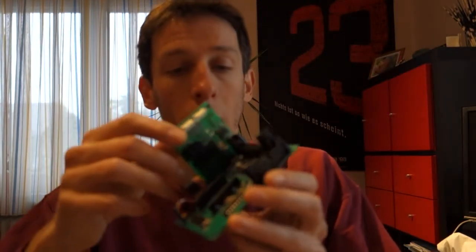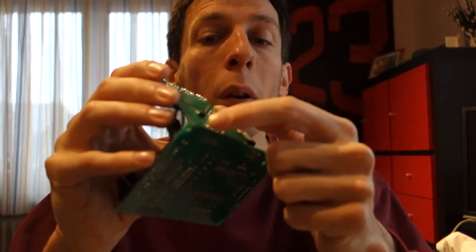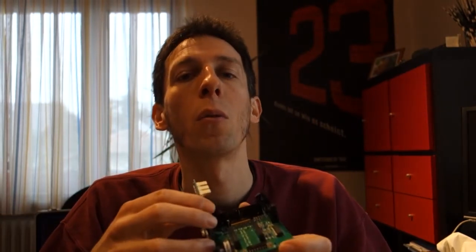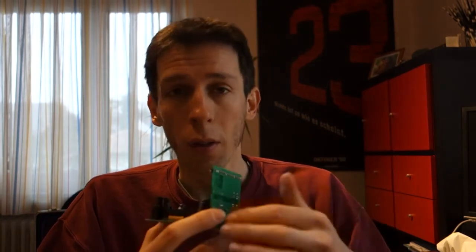The isolator on the new version still has a problem. The under-voltage lockout pin isn't being used, so I tied it to 5V — which was a bad idea because it goes directly into a non-5V-tolerant pin on the STM32. Through the body diodes of the processor, it injects current and raises the operating voltage from the desired 3.3V up to 4V. I'm glad I didn't break any processors, but the ADC started going crazy and everything became weird. I just cut the trace and that solved it.